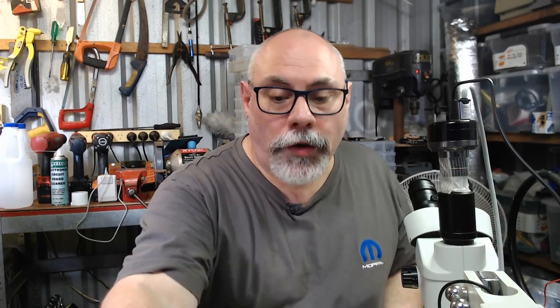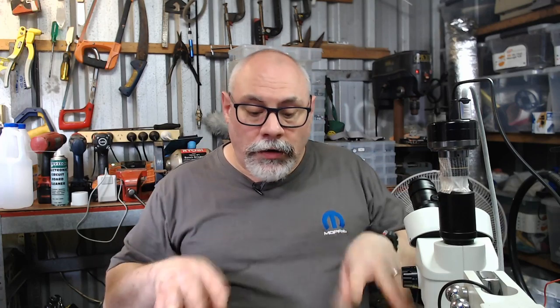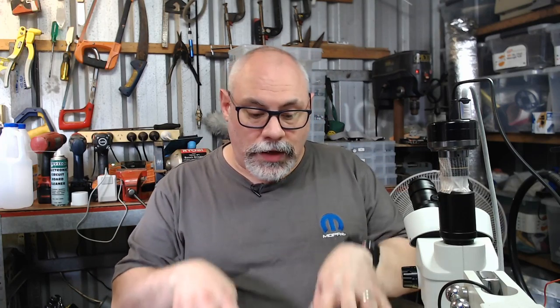Now, another thing I should also mention is that I generally don't recap these unless there's evidence of a capacitor failure. It's a very different story to if we were recapping one of the newer ones, made after the capacitor plague, which, for those who aren't aware, is when there was a whole bunch of dodgy capacitors coming out of Taiwan. These are generally pretty good. Sometimes, yes, a capacitor will fail, but I found with these ones, when I get ones that are broken, it's not usually the capacitors that have failed.